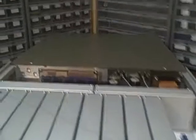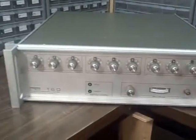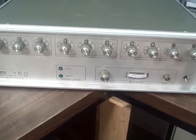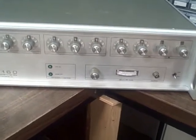We're going to close this unit up and put it through its paces, and demonstrate just how magnificent these things are. I love the control you have over the frequency — perfect for testing a frequency meter, or providing any frequency you want to an RF circuit, to filters, or whatever you'd like to test. For filters it's a perfect example: you could dial in exactly the frequency at the knee and test it.